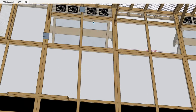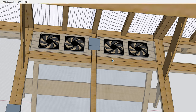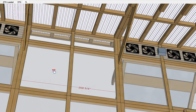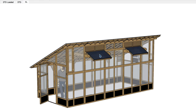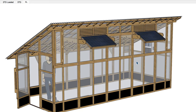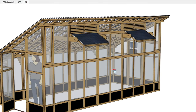We have specially made IP68 waterproof, humidity-resistant fans that are very quiet — some of the first fans we tested were too loud, and it's counterintuitive to have a noisy greenhouse. For the standard greenhouse, it's one solar panel with a bank of four fans. For the XL greenhouse, it's two solar panels and eight fans. It's all set up through the louvered vents, fully automated. It maintains itself, keeps the batteries charged, and goes into hibernation in wintertime when there isn't enough sunlight. It's a simple system, but it gives you much more control of ventilation through those back vents.